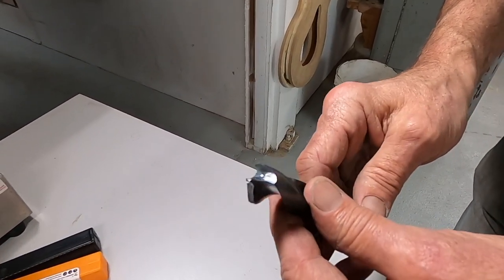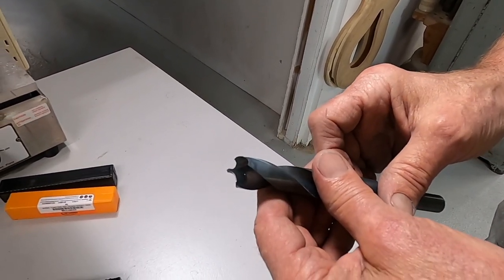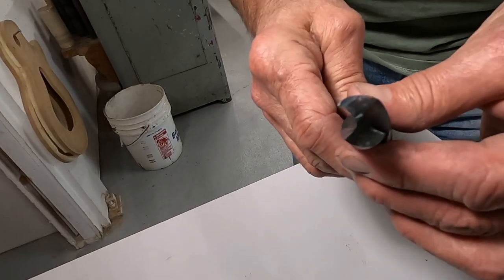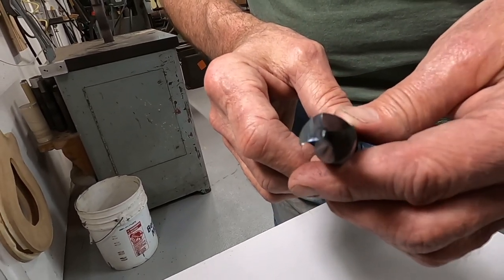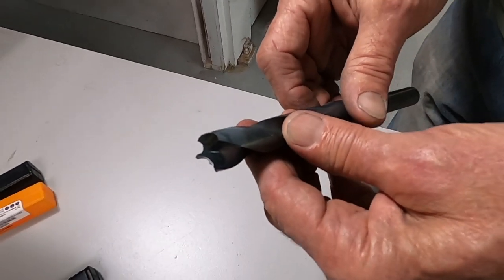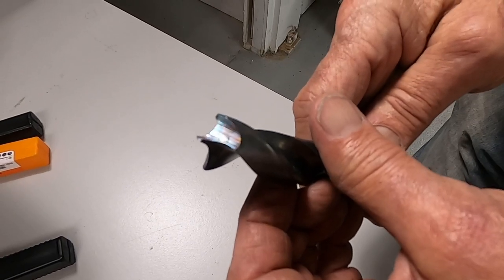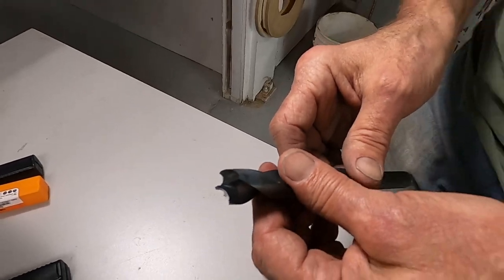material. This drill I'm grinding for a pal who is making a couple of hundred holes in mahogany posts that are going to be a fence around a deck, and he needs a lot of holes that are the right size to fit the tubing they're going to use. Anyway, so that's the job. And now we're going to go back in there, clean up the wheel with a dresser to expose sharp grains, and finish it off with a final grind.